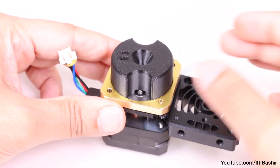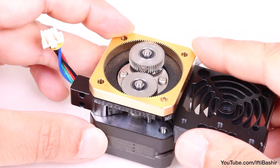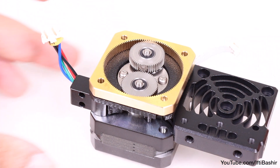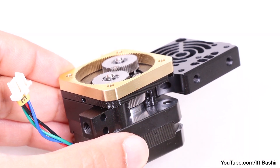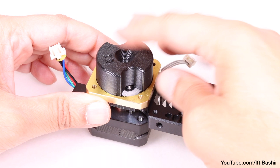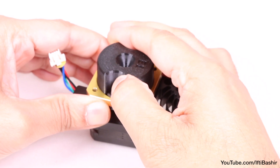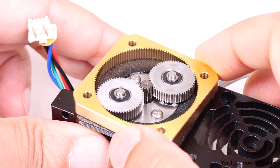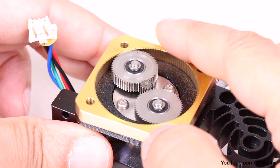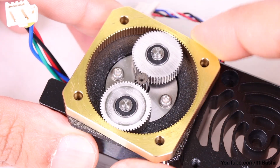After which the gear adapter can be removed. Inspect the assembly — it should look exactly as demonstrated here. The gear ring and the gear assembly should be completely flush. Also note that there must be no gap between the ring and the main plate. If you see a gap, remove the planetary gear assembly and reposition it once again. At this point you can place the gear tool back on the assembly to rotate and ensure everything is completely smooth. Although if you find the 3D printed part tolerances are too tight, remove the tool and carefully move the ring gear alone to ensure the cogs inside are meshed to the central motor pinion and freely rotating. The central motor pinion is fixed while the gears are rotating around it completely free.